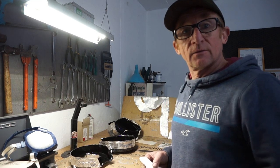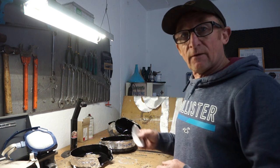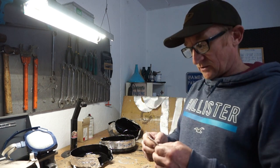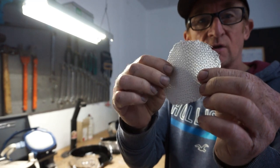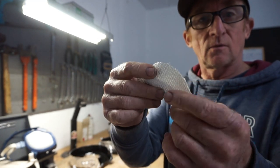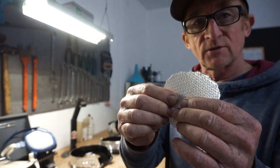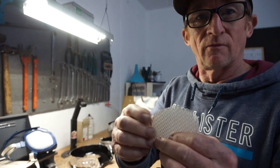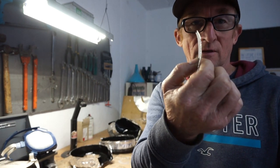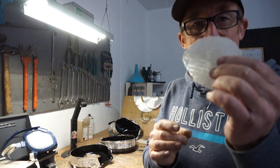Right, we've got three coats of gel coat into the moulds now, and I've cut some of the fiberglass matting. What I'm using is this fine fiberglass woven mesh. It forms really nicely and it's really super strong, and it allows you to have thinner fiberglass without being thick, so you don't get a big thick fiberglass cover. Mine are lightweight and slim, so I'll put three layers of this in, and that is strong enough. So